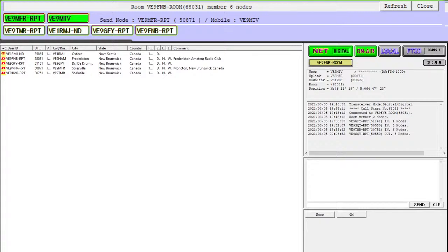My application is really verticals for mostly VHF, UHF, and I use dipoles for HF. I have inverted Vs for north-south on 80 meter, and 40 meter east-west inverted Vs. They tend to be less maintenance. They last quite a while, and I have pulleys and weights on the ends of them, so the wind and ice don't bother them too much.